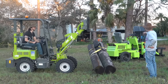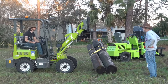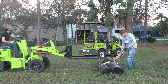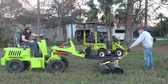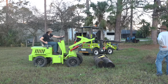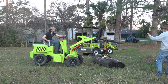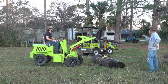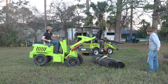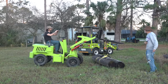Let's put this down and swap that in and pick it up while we're here — just stick it in the same loops. That's 290 kilos. Look at the way the fork is all skewed. It's pulling in because there's nothing to hold the bottom. So this was an interesting learning experience compared to an actual 800-pound rated machine — that thing didn't struggle at all. Here it couldn't lift two poles that together weighed 310 kilos, around 680 pounds.